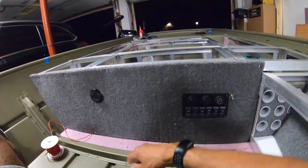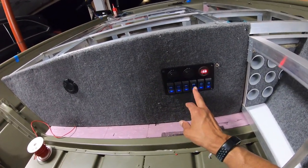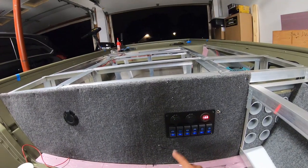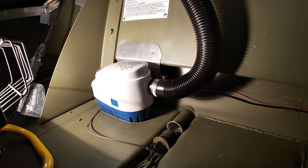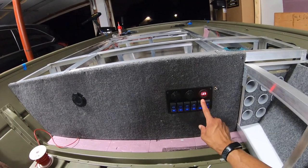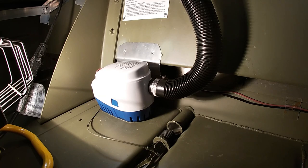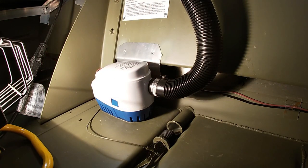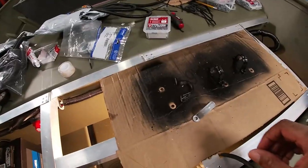Anxiously awaiting the test — let's do it in real time. We got power. This is for the bilge pump — let's give it a go. There we go — you guys can hear it. Manual power to the bilge pump is working. Now let's turn it off and do the rear test for the automatic switch — there we go. That's connected to constant power to the main battery, which will trigger the automatic switch built into the bilge pump to automatically pump water out of the boat.